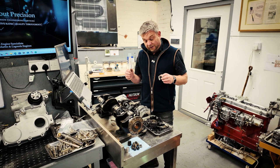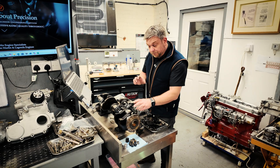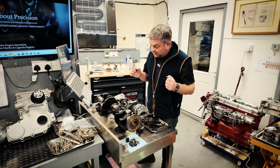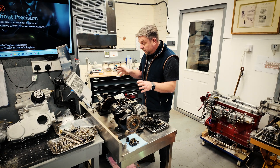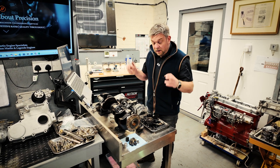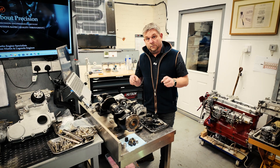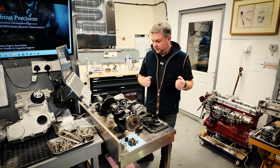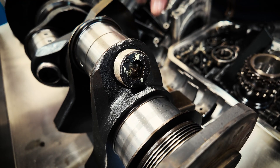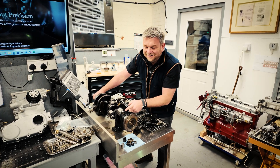We wouldn't like to know exactly what could have occurred in that situation — been extremely lucky. What we're dealing with here, pretty much like the cylinder heads, is these issues are all going to be resolved as part of the comprehensive rebuild, along with the main bearings which are worn down to the copper. The bearing surfaces on the crankshaft are worn as well, but we'll be re-grinding the crankshaft to the next undersize as part of the standard rebuild anyway. Everything that we're looking at — all the issues we've seen — are going to be completely rectified. If you look closely here, you can see the bung is almost completely out; there's probably only about three or four threads left in there, so that was just about to pop out. Really looking lucky.